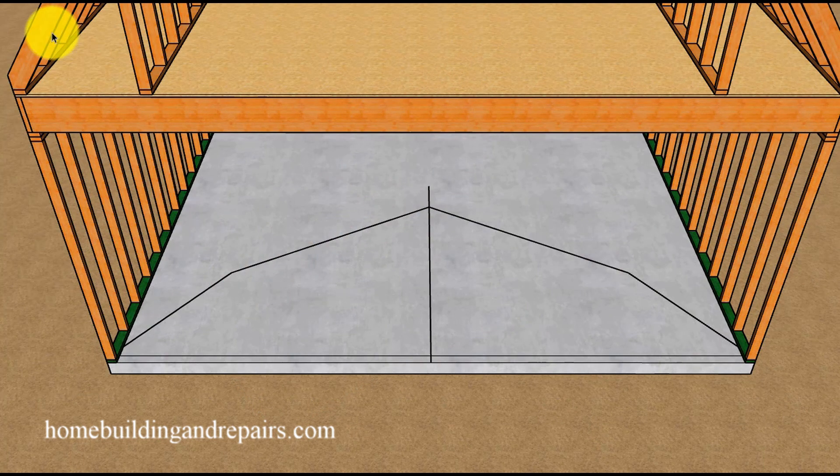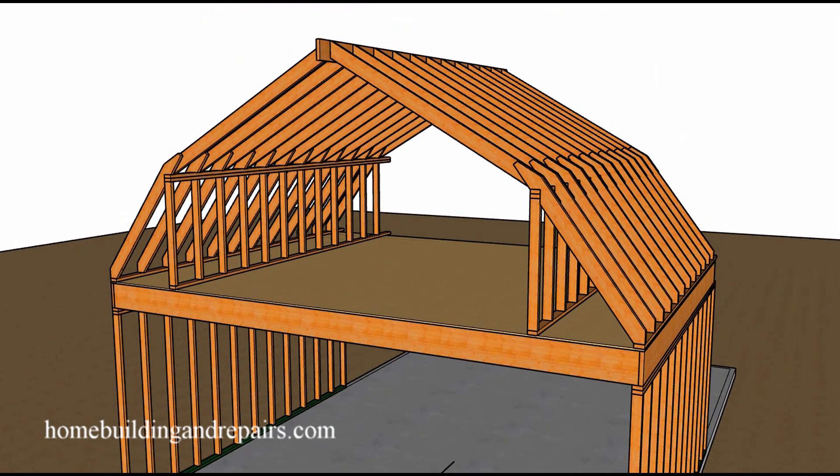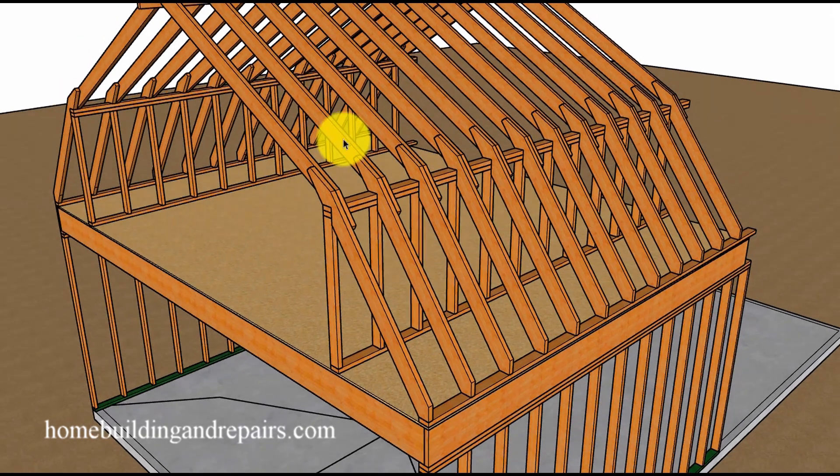This video would not be complete without an example of how these roof rafters and walls actually work. Let's take a quick tour. This is the section that could have been a little wider — you could use a 2x6 or 2x8 framing plate and cut the line straight across so the rafter sits on top. If a 2x4 layout is too confusing, just use a wider base plate. The rafters will lap here and can be nailed together with blocks installed in between.